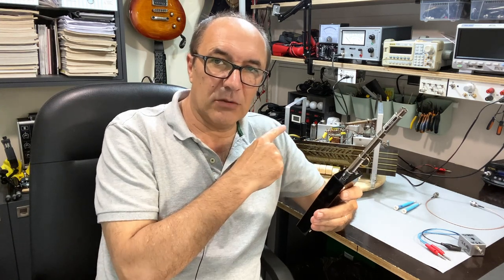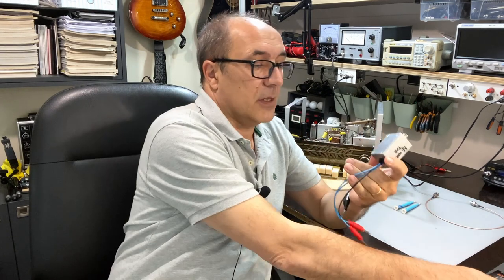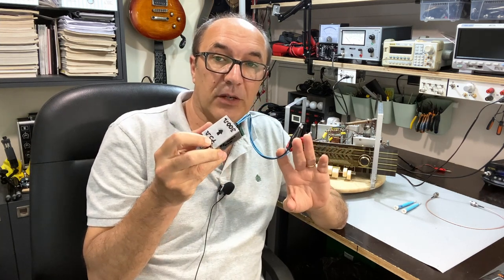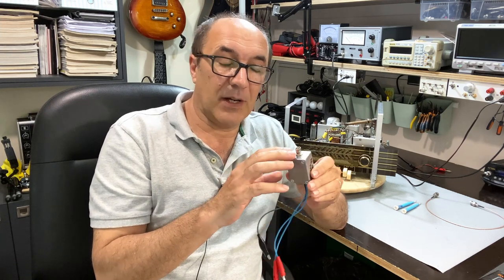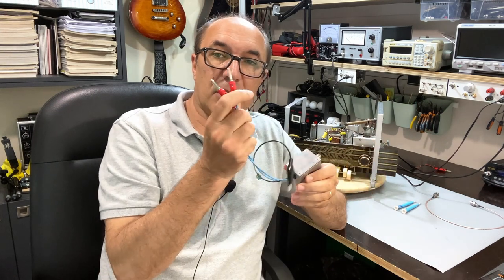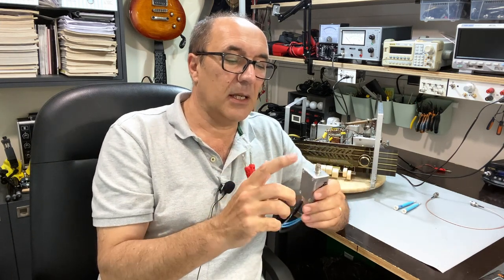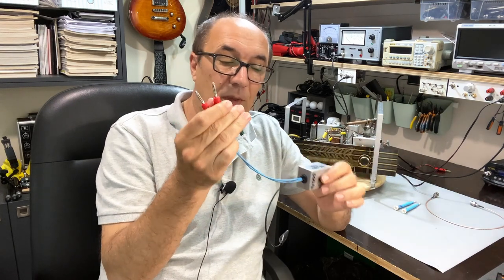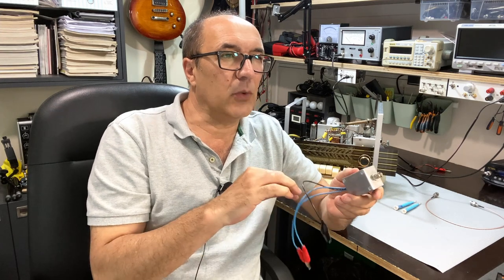There is still one little problem: this thing's a 75 ohm system, but our radio antenna normally looks for a 300 ohm signal. For that, you can build one of these — an L-pad, an impedance converter from 75 ohms to 300 ohms. You find these circuits everywhere. I built it just as a conversion from 75 to 300 ohms. At this end you stick it into the antenna and you have a balanced antenna signal. The signal comes in, through a coax, and into the radio. Generally, a 75 to 300 ohm L-pad has about 5.1 dB loss.